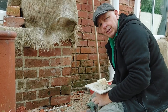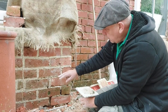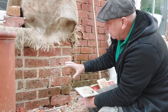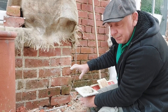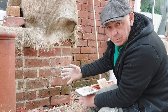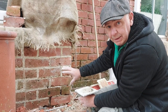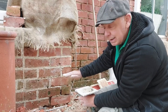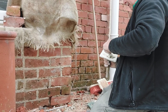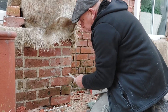If you've got a brick that's saturated and can't take in any more water, and you've got a little pocket — a little hollow inside your bed — the water will sit in that. As your brick starts to dry out, that water will soak into the bricks, taking a lot longer to dry than it should. So if the beds are completely full with no pockets where water can sit, it's a good solid structure as well.